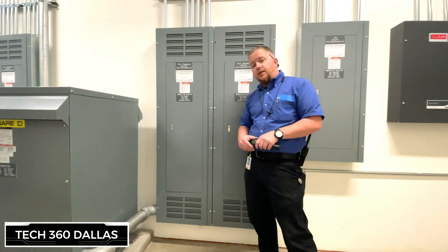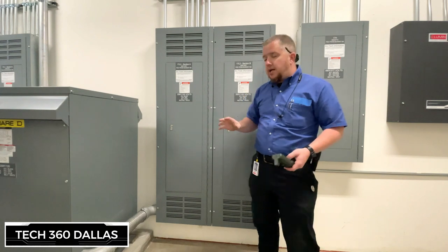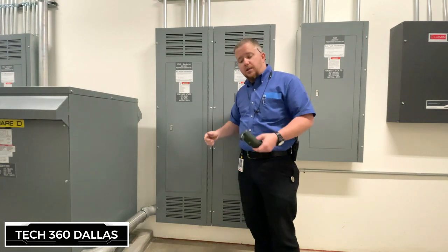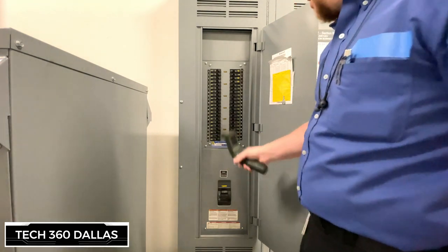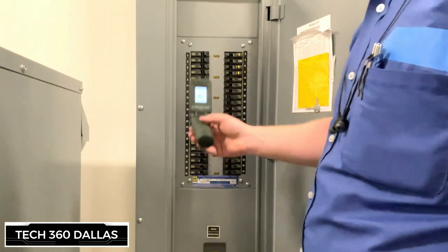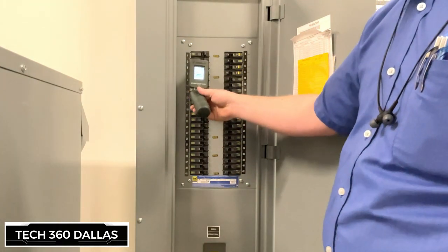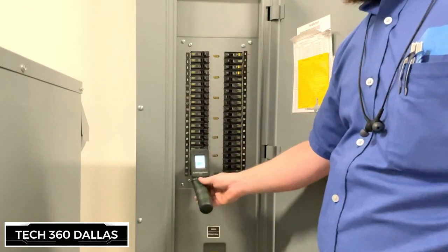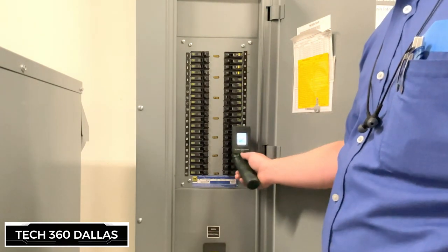As you can see, my plug out there basically says 17L2A — section A and section B — so it's going to be in this panel. We're going to open this up and show you how to do it. Now the panel's open and you have your unit on. You're just going to run this piece along the breakers themselves, basically scanning down each one. You can work in any direction — you don't have to start at the bottom or anything.